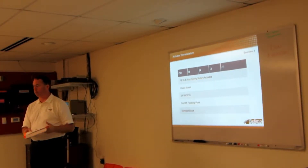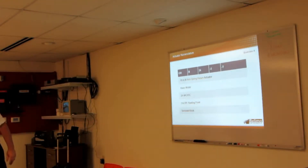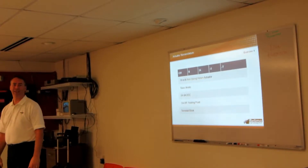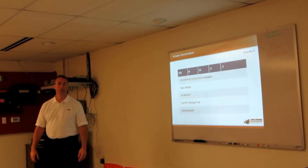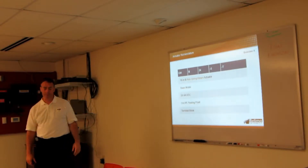It's able to be mounted outdoors. And I tell my customers, make sure you get your conduits fit tight on there, because the conduits aren't NEMA 4. So if water leaks into the conduit, that's where it's going to come in. I've had that happen already.